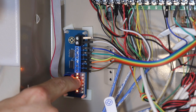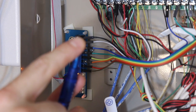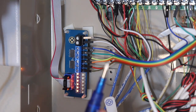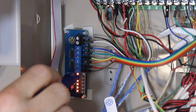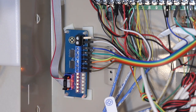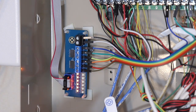And above each LED, there's a little dial. It's called a potentiometer. Okay, we're going to use the Phillips head tip of the connected screwdriver to very gently, with very gentle pressure, put it in one of these tunable dials and twist it to dial in that resistance. Don't apply much pressure here because these things are quite fragile, and the tips can strip very easily. They're just made out of plastic.